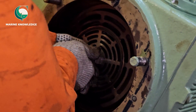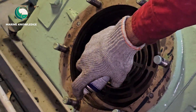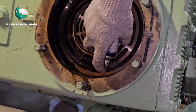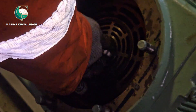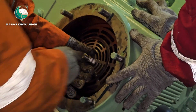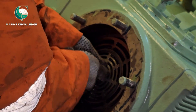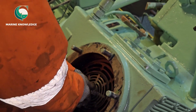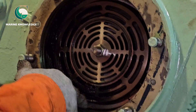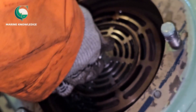What we need to do is spray a little WD-40 on the side of the LP valve so that the carbon deposits can be loosened and the valve will come out. We are still struggling to remove the valve, and this may be one reason why we are getting low efficiency from the LP side. We are just shaking it so it gets loosened. You can see the dark color on one side — a lot of carbon deposits — which may have stuck on the liner surface. Somehow the third engineer managed to remove the liner.